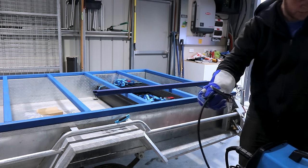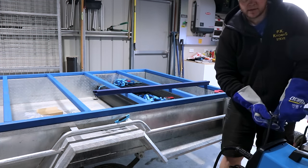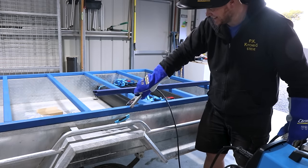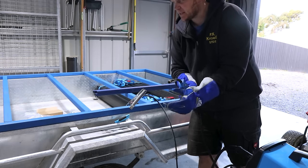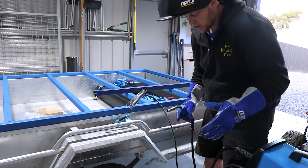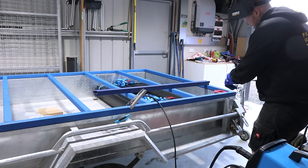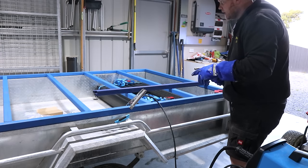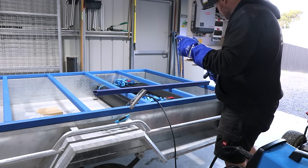We're getting there. I'm not going to weld right now because Toby's in here, but tonight once he's in bed I'll come back out and see how I go welding that up. Slight change of plans — I went and got the gas hose tonight. Had a couple of practice runs and I'm just going to go in and do it. This could end really badly and I could have to cut all this stuff up — but that's the advantage to metal: you stuff it up, you cut it, you redo it. It's not the end of the world. I've got the angle bracket on, I've marked everything where it needs to go, and I'm just going to tack everything to start with — just a little tack to get it in there, check it for square, and then go back over it.